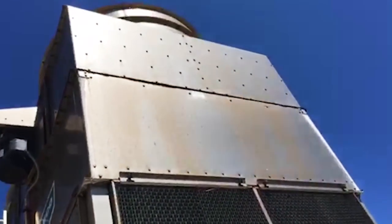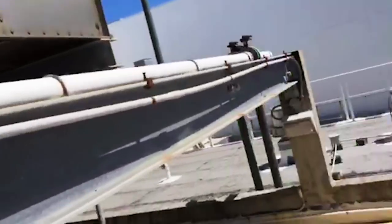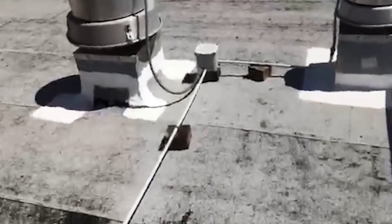While I'm over here, there are our motors for our cooling tower fans — they're belt driven. Those big fan shrouds there, pulleys on top of those motors and belts. They just look like a big condenser fan blade; essentially that's what it is.